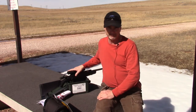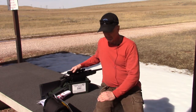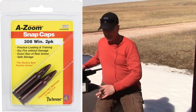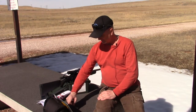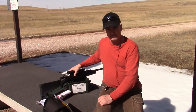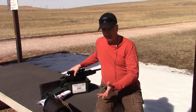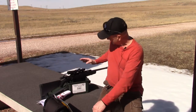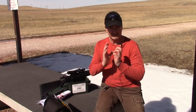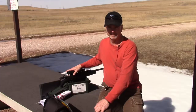When I weighed it the first time at the heavier weight I had two aluminum snap caps by Zoom in the magazine, so it probably would have been just under eight pounds without those. According to Jeff Cooper, the Scout rifle should be under seven pounds and have a 19-inch barrel — this has a 16-inch barrel. I do think this rifle would benefit from a 19-inch barrel but with a slimmer profile, something more like the fluted barrel on our MVP Predator, to get that weight down. This rifle could definitely use some weight loss.